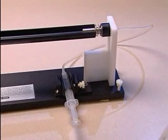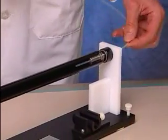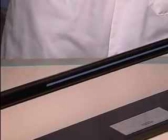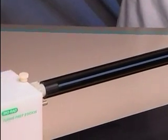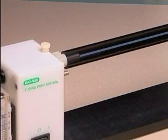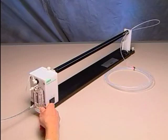Ensure that the tubing is completely dry by purging it with nitrogen. Insert one end of the roll of gold coat tubing into the opening on the right side of the tubing prep station. Push the tubing into the hole and into the tubing support cylinder. At the opposite end of the tubing support cylinder is an O-ring, and this will give slight resistance as the tubing is pushed the final half inch. Using the knob on the flow meter, turn on the nitrogen and adjust the flow to 0.3 to 0.4 liters per minute.